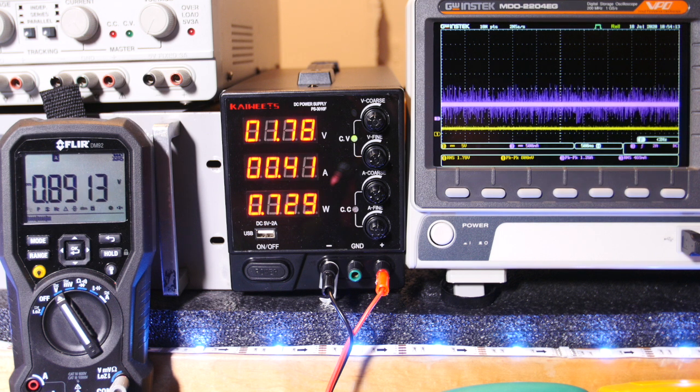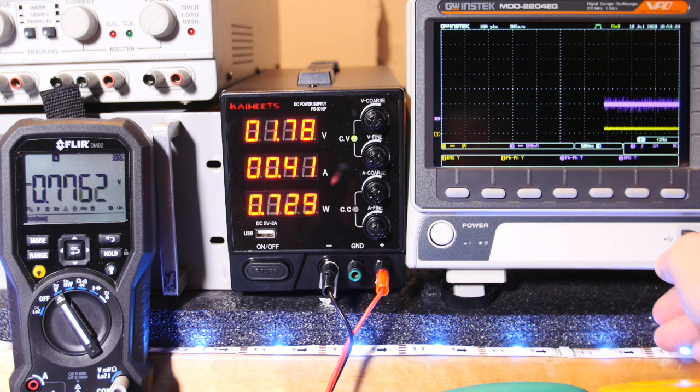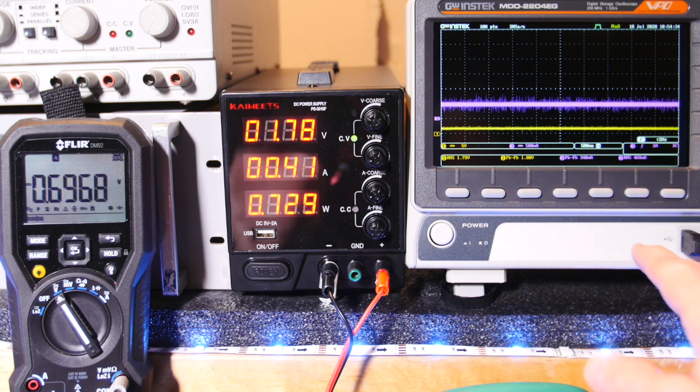But let's just see if I go to my channel 3 and bandwidth and limit it to 20 meg. Yeah, see, that cleans up a lot of it right there. So a lot of that's really high frequency stuff. You know what, I have that one mic cap that I showed you before. We'll see what we can do about the noise later on.